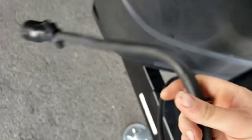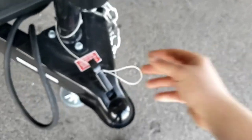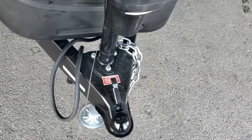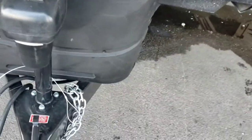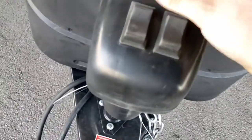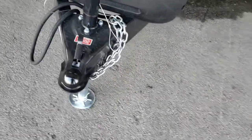You've got your seven-way plug here — this plugs into the back of your truck and operates your brakes, lights, and everything. Your truck will need a brake controller for the brakes to function. You also have a breakaway cable that hooks to that box — if the trailer were to come undone from your truck while towing, it'll pull the pin out, lock up the trailer brakes, and keep it from rolling into traffic or slamming into the back of you.